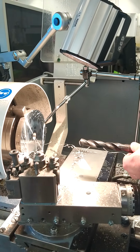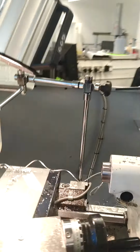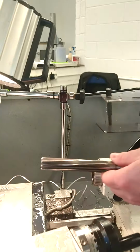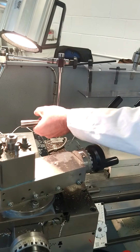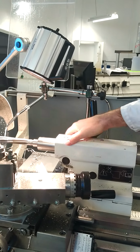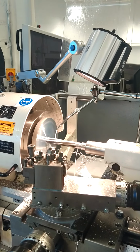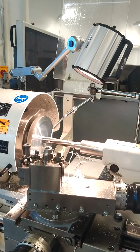The next thing now is to replace the tool. To remove the drill every time, I'm just winding back on the tailstock and it pops the tool out. Finally then, the 20 reamer: you put it in position, wind forward again, 56 millimeters, and slot it in position. The speed is staying the same, as we're in training, at 540 RPM. Leave the quill lock off when you're drilling, don't have the quill lock on, as that will stop you from drilling. Powering on the lathe, you're drilling in, only removing a half millimeter, so it's twice as fast to feed, and we have a feed. And back out. And that's the process done.